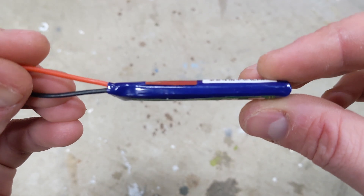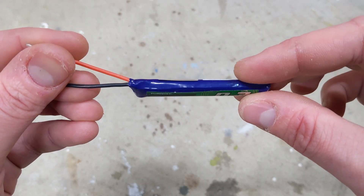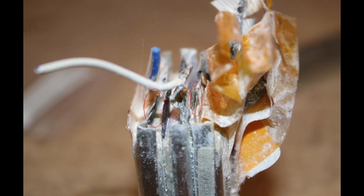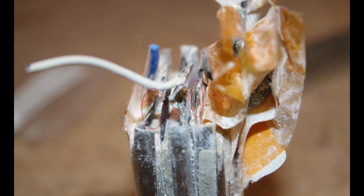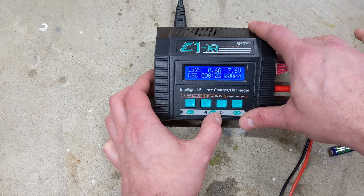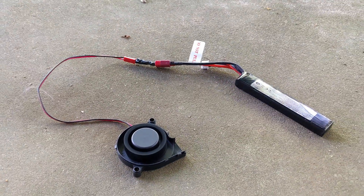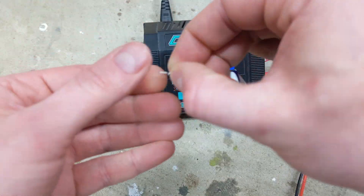If you do have a puffed LiPo or you manage to run a LiPo dead, it should be disposed of — but first it's necessary to ensure it has no stored energy remaining. One common recommendation we see online is to immerse the battery in saltwater, in theory allowing it to slowly discharge through the conductive water. In practice, saltwater will rapidly corrode the terminals until they stop conducting electricity, and you may wind up with a battery that still contains energy but can no longer be discharged. Not good. Instead, we suggest using the discharge function on your smart charger, but if the battery is so far gone that the charger won't recognize it, hook it up to a light bulb or computer fan. Either way, do this in a safe and fireproof location, let it run until the battery is completely dead, snip and twist together the wires to short it, and then dispose of it with electronics waste.